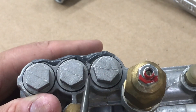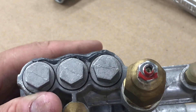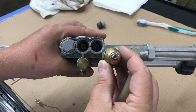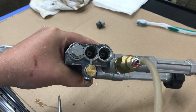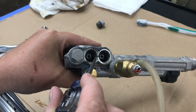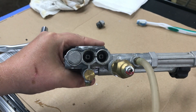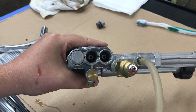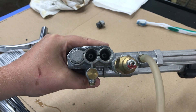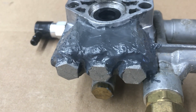It's really hard to see but you can see right there — there's a crack. I'm going to take these two bolts out and see what it looks like. Okay, that's not looking good. You can see here that this is completely cracked between these two chambers. That's going to be hard to fix with those threaded bolts — but it's not any good like it is, so I may just JB Weld it up, put the bolts in, weld over them, and see if it'll work. Let's give it a shot. It's not pretty but hopefully I've got all the cracks covered now that I didn't see before.